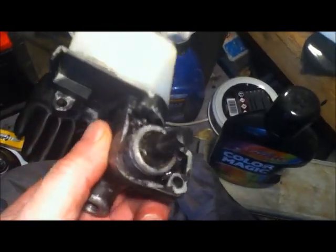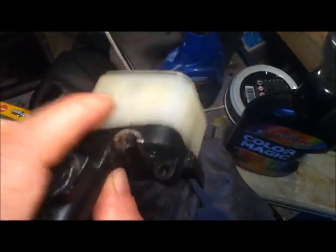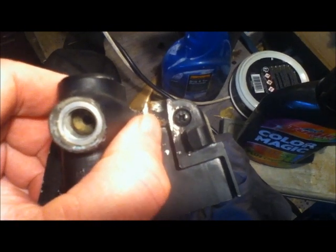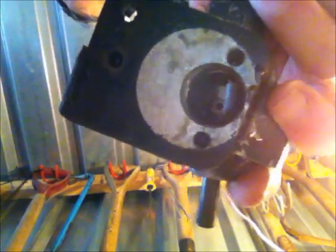I've given it a good scrub with white spirit and it's now relatively clean. You can also see the circlip now — look how much dirt came out of it. I need to carefully clean that and change the o-ring that sits in the base. There's a screw that allows me to undo the reservoir base and gently pull it off, so I'm going to do that first.